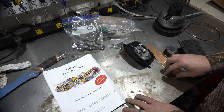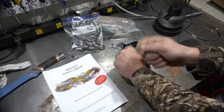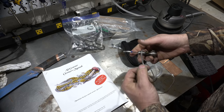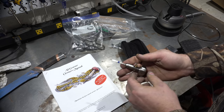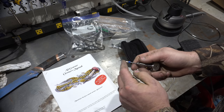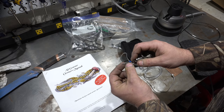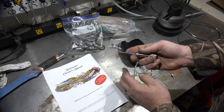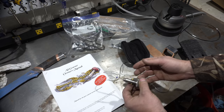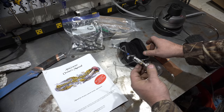Let's talk about the equipment. When we talk about hand engraving, I'm going to be talking about a pneumatic engraver — not the kind where you take the graver and a hammer and you're chiseling it. That's very, very difficult and very error-prone. What I'm talking about is using one of these. This is just a pneumatic air-fed engraver. It has a piston inside, and the air will make that piston go up and down a whole bunch of times a second. You have a graver, which is basically a sharpened chisel, sharpened at very specific angles — we'll talk about that. This particular one has a bunch of features, and it has a foot pedal that increases the rate the piston goes up and down, and that's what causes it to move.